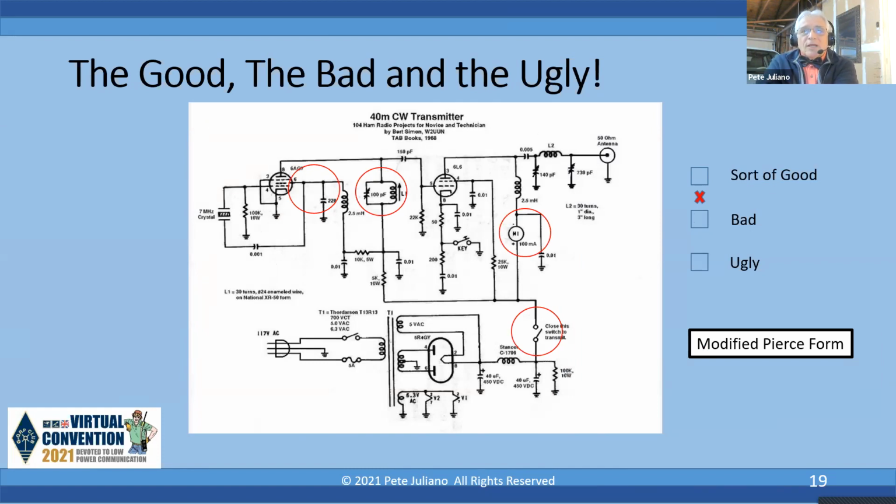First, high marks: 3-wire plug. There we go, 3-wire, and it's got a fuse. Hey, how about that? And if you looked at the electrolytic capacitors, they're at least a reasonable size. You're probably going to get maybe 25 volts of ripple. But indeed a good job. He's got a nice bleeder resistor on there. And for the moment, just ignore the circle around the switch, and let's assume the switch is closed.